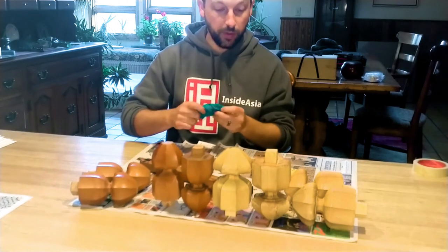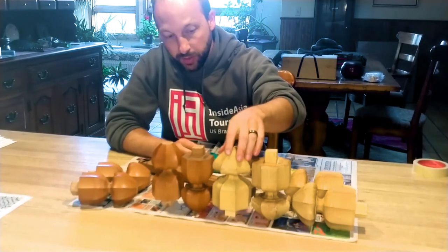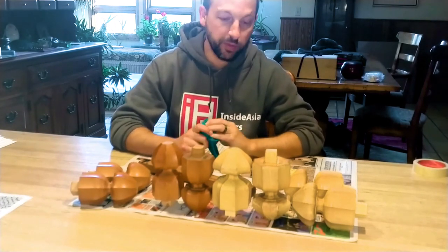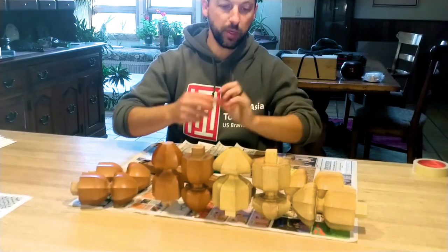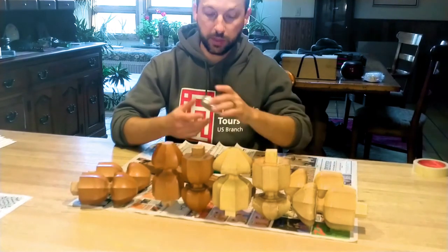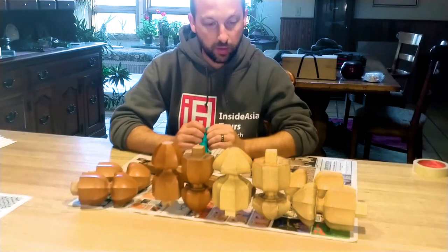Give it a little longer just to be safe, or if you're in a colder climate, more humid climate. Again, curing is very different than drying. These might feel dry to the touch by now. No, still a little tacky. Not dry to the touch, but they'll feel dry to the touch within maybe 12 hours, but they won't have finished curing. So that oxidation, polymerization process isn't finished. And you probably want to keep them in a ventilated area, especially if you're using some kind of boiled linseed oil mixture, because you've got those volatile organic compounds coming off while you work.